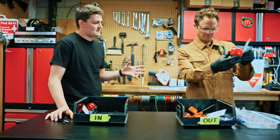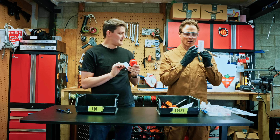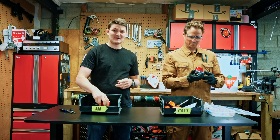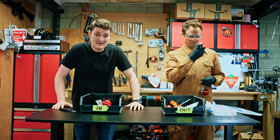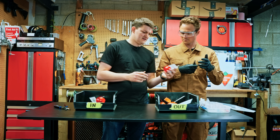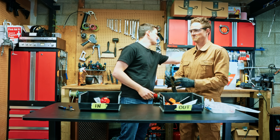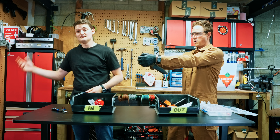The risk here is a waste of time, because if I overload the downstream, then I've just got to twiddle my thumbs and wait while he runs through his inventory. Of course, if he rushes to catch up, then it risks the waste of everything — producing a defective part that just needs to be disposed of, rendering everything upstream Muda.